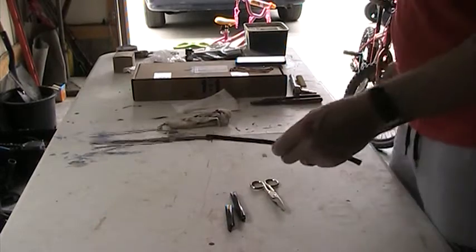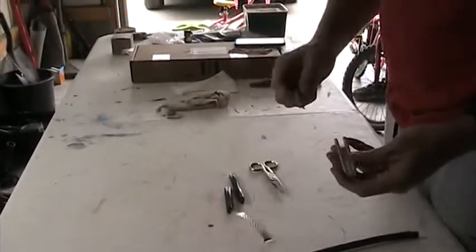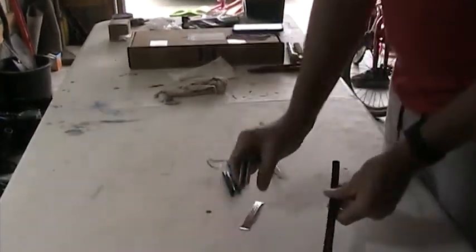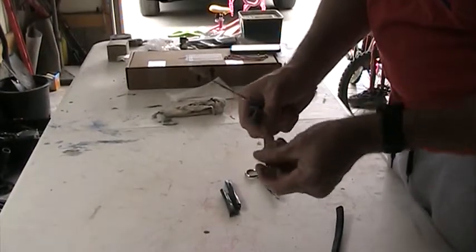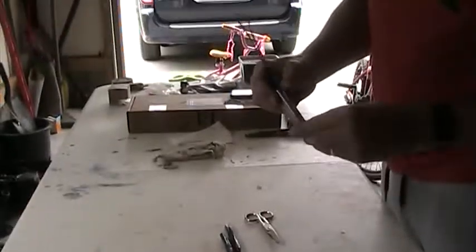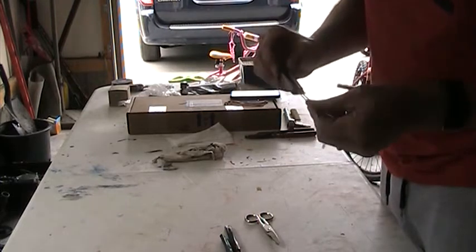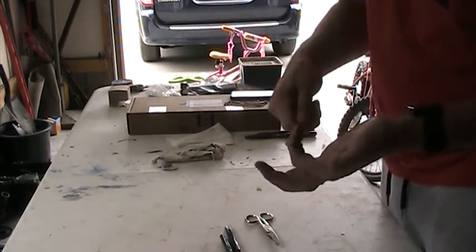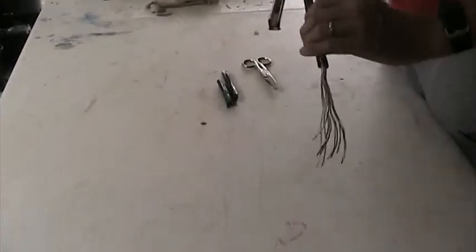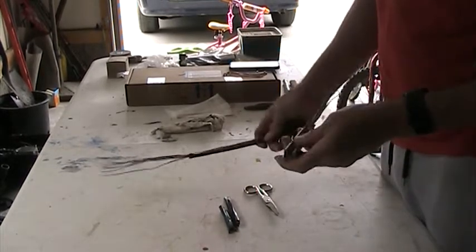The other option with this, and unfortunately I got the wrong size, this is your hanging hook. So what you would generally do, this is made for 2-pair drop wire, you would slide this over top, and then this piece, which has got a rough edge to it, which grips onto the plastic sheeting. So once you get the drop inside there, you put that little clip in there, and then you would wedge this in here, and that would hold it really securely. And then this would go onto the hook on the house, or if it was on the terminal side, this would go onto the hook on the pole, and that way your drop is secured. So you get this as tight as possible with as little droop as possible, and that makes sure that it stays at the correct height.